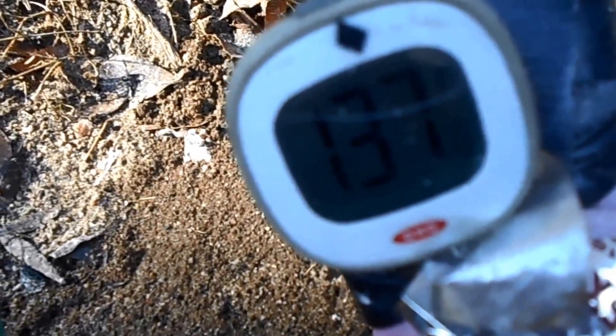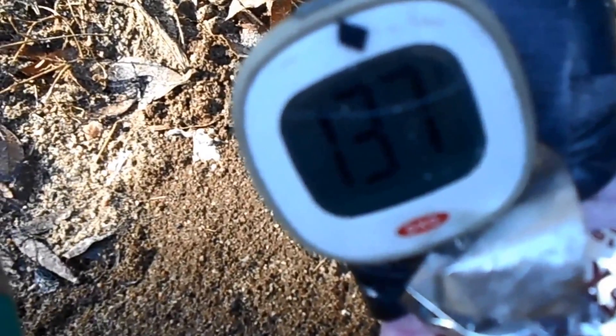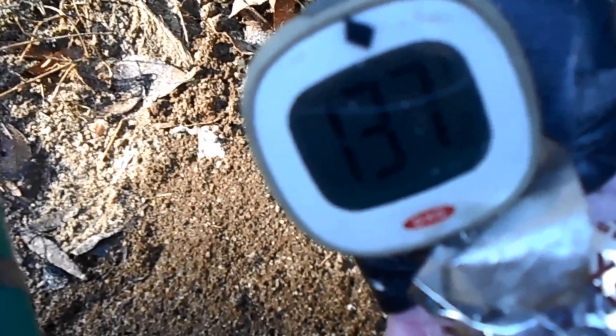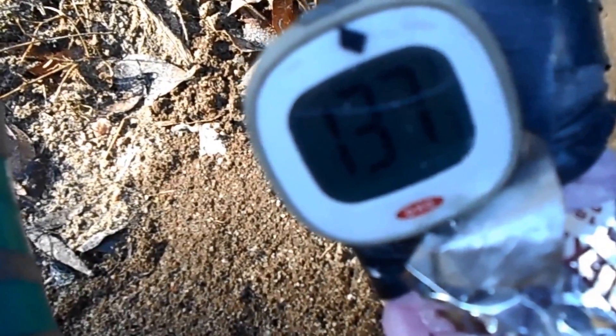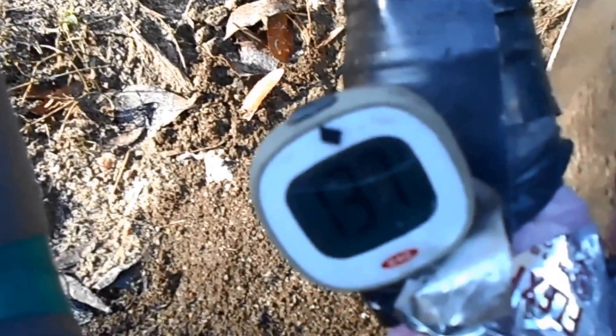This one is 136.6, coming from the tank inside the house. So it's got a mixture of about 180. Anyway, it's mixing in there. And this number — even after you cut the fire out — it'll keep on thermosyphoning. That hot water on the top of the tank will keep going up that line. I don't know how long it'll keep going, but it'll keep going for at least two hours, heating up.